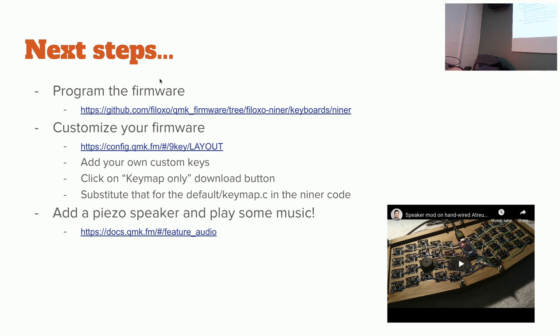So what makes it mechanical? The switch that's on it. These are mechanical switches in that there's metal making contact. What you have in most membrane keyboards is a capacitive dome, so there isn't a mechanical movement. It's just a squishy rubber thing coming down, I think a silicon pad that's just making continuity happen on the PCB. I see. Yeah, I've seen the inside of those, but I didn't know what the difference was.